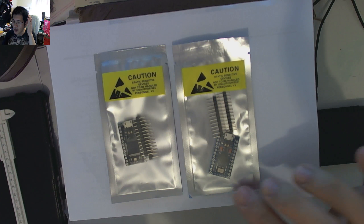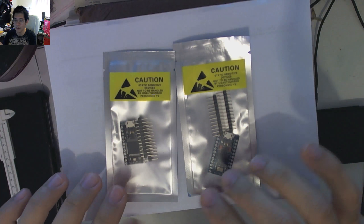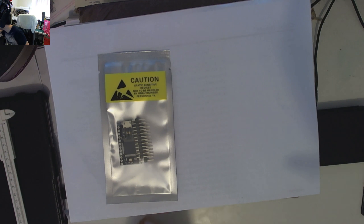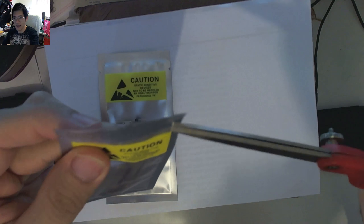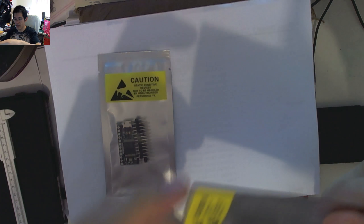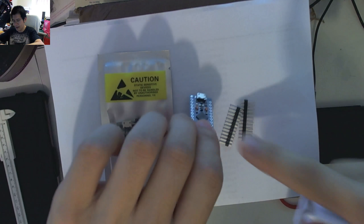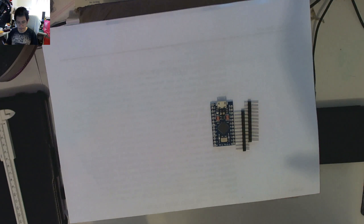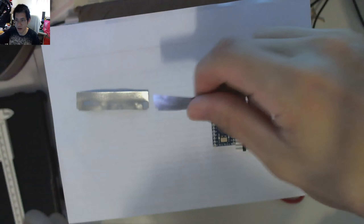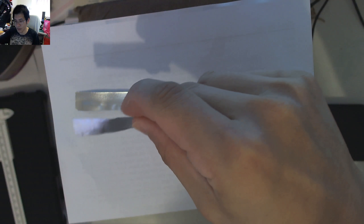I'm going to pull them both out and check how they are. If they don't have the same physical footprint, I'll have to develop a different footprint for the black one. A lot of the time with these sealed packs, the tear point is too high and you still can't open the packet even at the suggested tear line — which is a little annoying. The black one was sealed well with a nice ripple crimp pattern, but the blue one was really horribly sealed — just flat melted plastic.